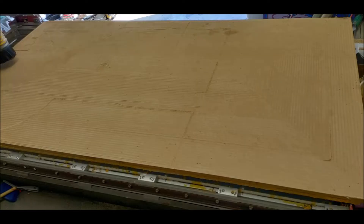I have a few quick things we need to cover before we get started. First off is the spoilboard, or the cut surface for the CNC machine. This needs to be perfectly level before you get started. I don't have a vacuum table — for me it's a spoilboard, which means that you actually cut into the board as you're doing your project. So I want to surface the board before I get started, which winds up giving me a nice flat substrate to start with.